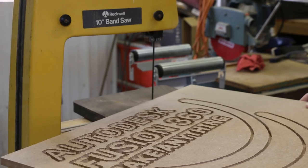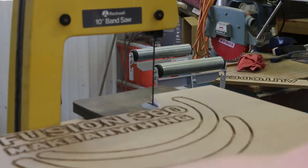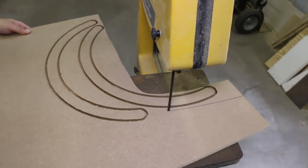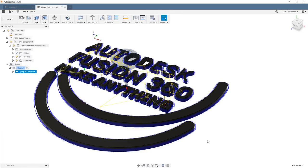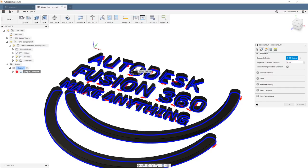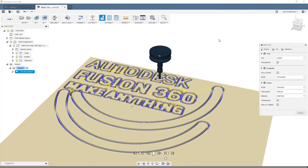I added a 3 millimeter offset so the cutter stays 3 millimeters from the bottom. One of the things I loved about Jimmy's video was his use of the bandsaw, and I had this old bandsaw my father-in-law gave me for free that I'd been restoring. I'm really just using the Stepcraft to make my life a little easier. On the passes tab I turned on multiple step-downs at 2 millimeters. After simulating, I noticed I had forgotten the centers of the 'O' and the 'D,' so I went back to edit the geometry and add those.